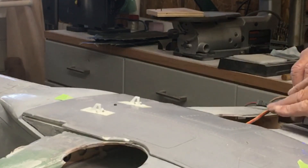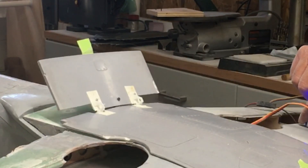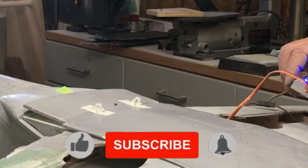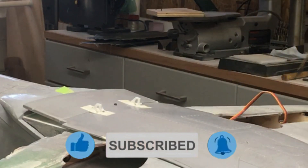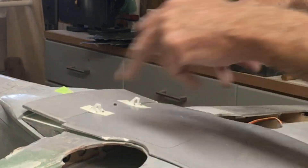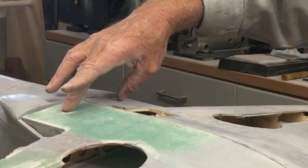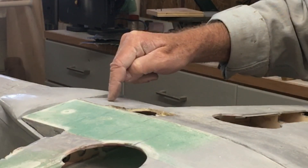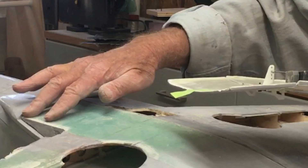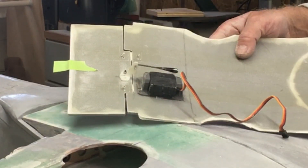Those wings have some voids so we're not going to use them for flight. I've done the speed brake and this is what we've come up with - it works. The problem is the speed brake fits flush into this area, and the bolts go in here, so I'll need to modify the wing mold to add a recess. I've also had to gouge out the wing for the speed brake servo, which is mounted in a 3D-printed adjustable servo mount.